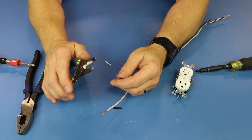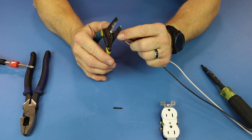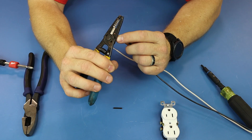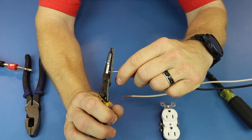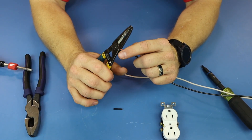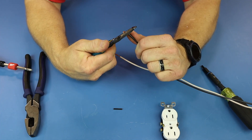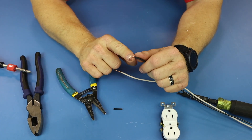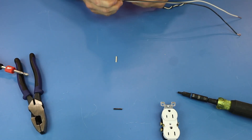When you're going to make your curls, all you need to do is put the very end of your wire just barely through the hole like that. You want it so your wire is just barely hanging out. See the copper on this side? It's barely hanging out. Then you want to bend it away from you using that hole, and you want to hold it tight. You want to make this tight — push toward the floor while pulling the strippers back toward you, because you want to make that hook very, very tight. You don't want a hook that looks anything like this loose one here.